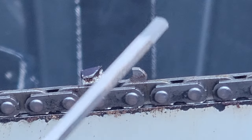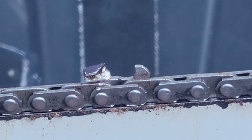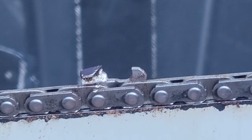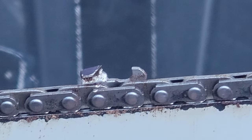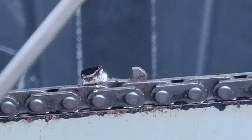I did notice that you have to be real careful with the rakers, because it'll make the wood chips really long and they'll get stuck inside the saw, especially if you're ripping. So you got to be careful with the rakers when you're doing the square grind or triangle grind. But honestly, I'm going to go back to just using the Oregon grinder, the electric one. It's not quite that quality you can get out of hand filing, but it's so fast. And if you're cutting a lot of firewood, especially in dirty wood, you don't want to be wasting too much time cutting on or sharpening that saw blade.